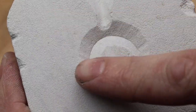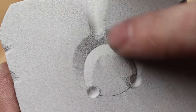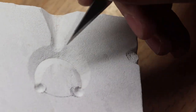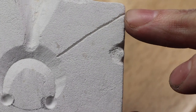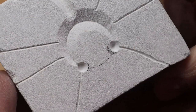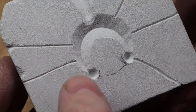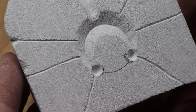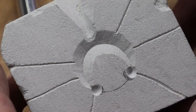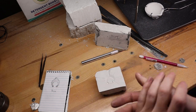The only thing left to do is make some little air escape lines. When it fills up with liquid silver, those lines give the air that's already in there somewhere to go. If you skip this, you'll get bubbles or weird spots. I'm carving little lines all the way out so air can actually exit. You don't really have to worry too much about liquid metal coming out of these — once it goes through the tiny area it probably won't make it all the way out, and if it does it will solidify and block them. It will just leave little spurs on the outside that we clean off.